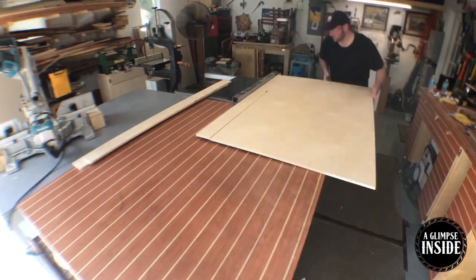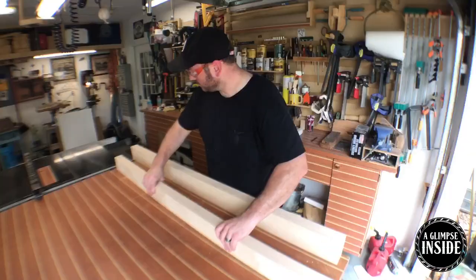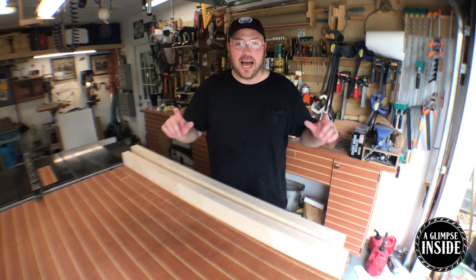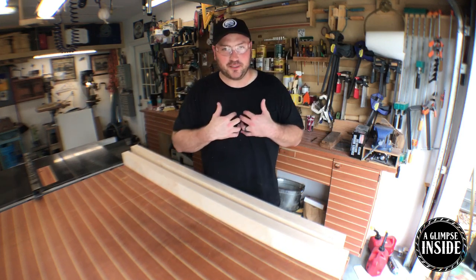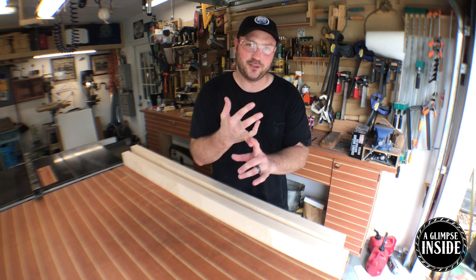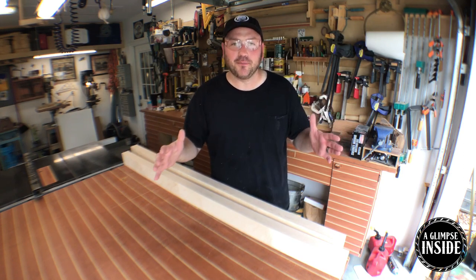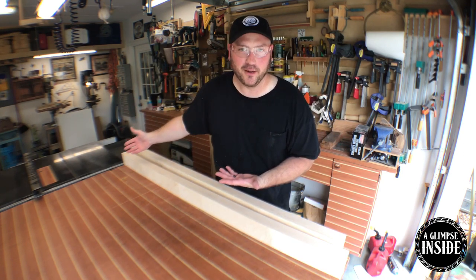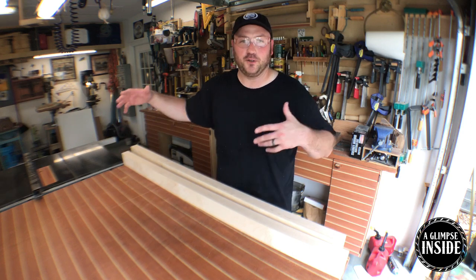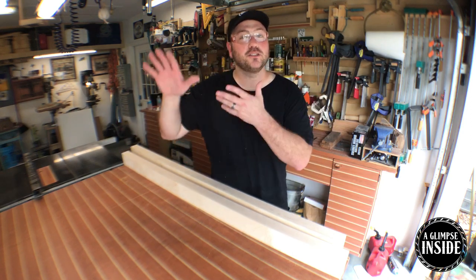Here I'm taking some half-inch Baltic birch plywood and I'm making four strips at four inches and four strips at three and a half inches. I have plywood here in my shop, but honestly this could be made from one-by-fours and one-by-threes that you can purchase at a local big box store. The only cuts you would have to make are the cross cuts for the size of the picture you're trying to frame. You don't need a table saw, you don't need to rip any boards.